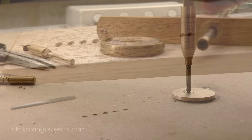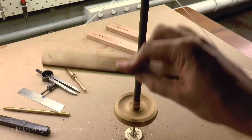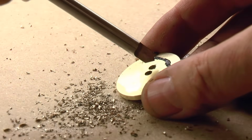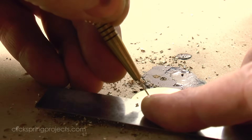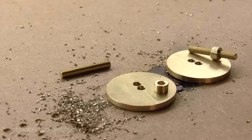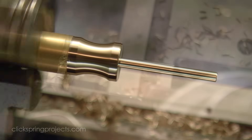The trammels require a robust pivot to perform accurately, and I chose to use a small tool disc in which to drill the pivot holes. For the sake of this video I'm going to call these discs pivot buttons, but they need not be disc-shaped — any scrap of metal of suitable size and flatness would have done the job. Sleeves and alignment pins are required to locate the pivot buttons on the dial plate, as well as a removable pivot for the trammel. I've chosen a shape for this pivot that I find convenient, but it need not have looked like this at all, and could have been as simple as a pin tapped into position with a hammer.